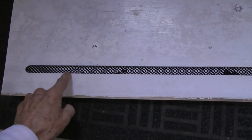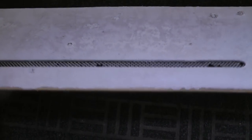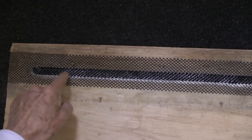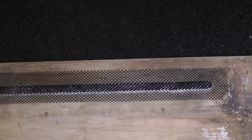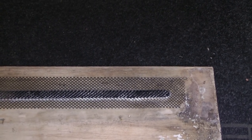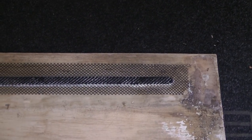This is a piece of the original soffit. You can see there's continuous ventilation all the way along - it's made of wood. On the back is a soffit mesh - it's plastic, and it's to keep out bees and wasps in particular. Wasps are less problematic because they all die off in winter. But honey bees can be there for years and years. If you go on the internet you can see the problems of getting rid of them - it costs an absolute fortune. And they do a lot of damage - tons and tons of honeycomb all piled up in your roof space.